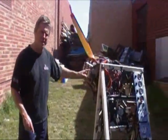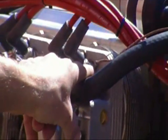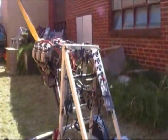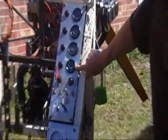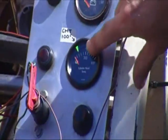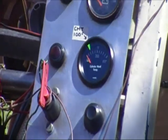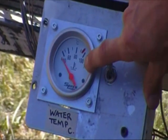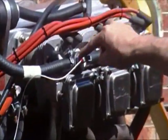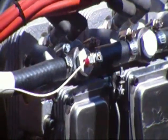We are measuring temperature in two places. We're measuring the CHT under the spark plug on the exhaust side — that's a typical CHT measured in Fahrenheit. The gauge that thermocouple is controlling is this CHT gauge here, and I've already pre-calibrated the thermocouple in boiling water. That mark there indicates 100 degrees Celsius, which is a little bit over 200 degrees Fahrenheit. We've also got water temperature measured in Celsius. This gauge reads around 7 to 8 degrees Celsius higher than it should — it's a thermocouple screwed into the water jacket via a banjo bolt, which is also picking up cylinder head temperature being that it's an aluminium bolt screwed straight into the head.